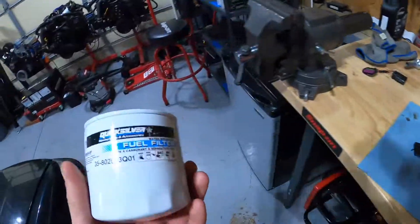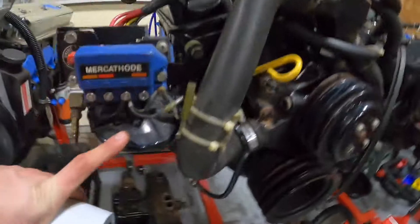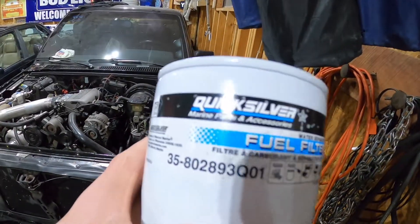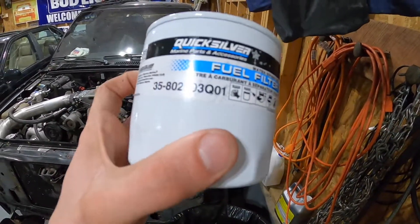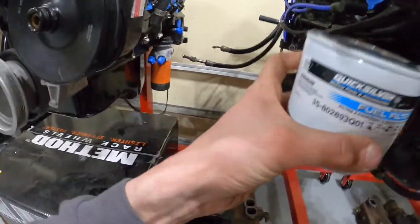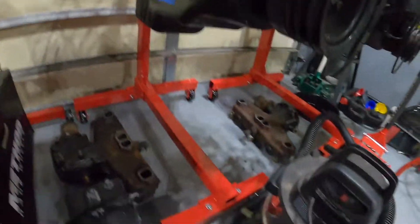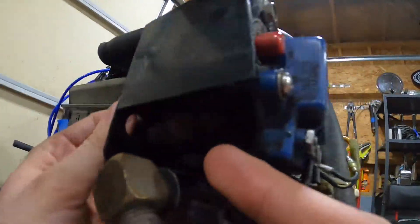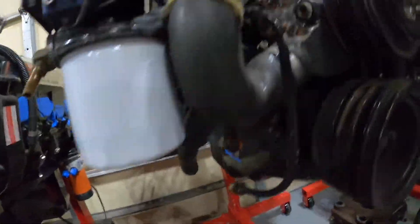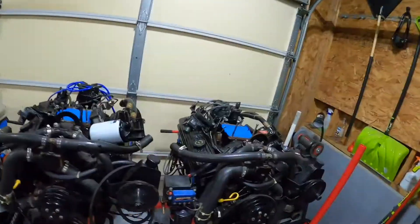I've gone through two GoPro batteries tonight. Got the fuel filter off — it's set up the same way as the oil filter and it looks like it's in decent shape. Goodbye old one. The new Quicksilver filter — part number 35-802893-Q01 — it's the same part and they're white. I kind of like it: white with the blue, makes it look fancy. Just hand tight, that's all you need. And that's it. Now I've got a whole other engine to do. Thanks for watching — it's getting closer to boating season every day and we've got to be prepared.